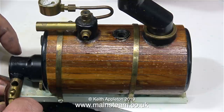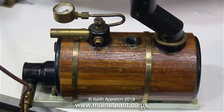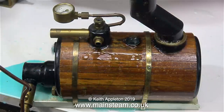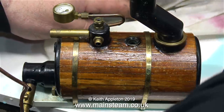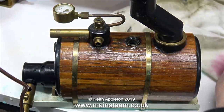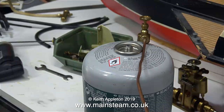What you can't see in this clip is I have my nose over the chimney, and when combustion is efficient there isn't much smell from the chimney. Once again, another health and safety warning: eye protection must be worn. Be very careful — as boiling point is reached the whole thing boils over. Not a big problem, but without eye protection with my nose over the chimney, that could have been bad. All I need to do now is leave the hot kettle descaler in the boiler. And as a final health and safety warning, don't forget to always remove the gas adapter from the gas canister once you've finished playing with your steam plant. And that's it for this one — thanks for watching, and I hope you found it useful.